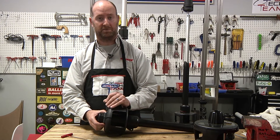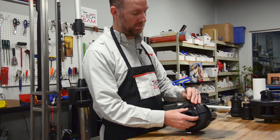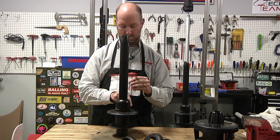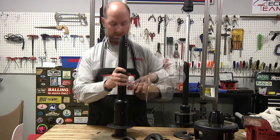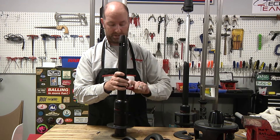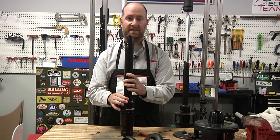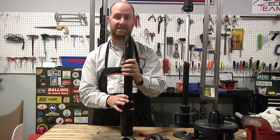Here is the conversion of the Mark IV to race mode. Simply remove the two screws on the bottom of the unit, which will remove the guard assembly. The removal of six screws allows the furler to be converted from a Mark IV with furling capabilities into race mode. Once you get to that point, the next step is to remove the screw on the feeder, remove the feeder, slide the halyard swivel down below the feeder, and reattach the feeder — at which point it basically acts as a foil system.